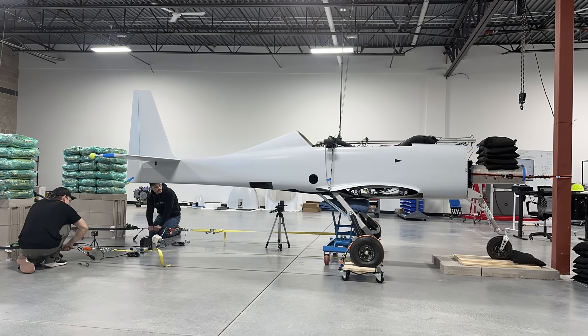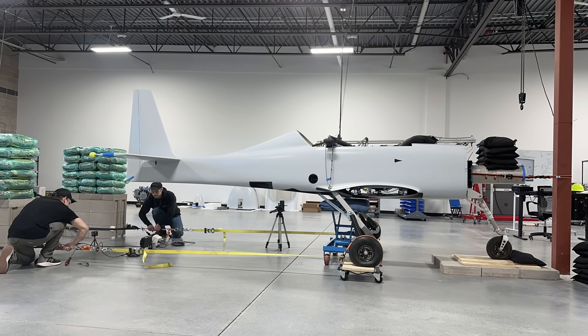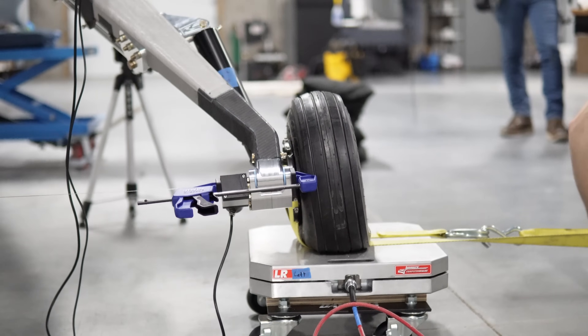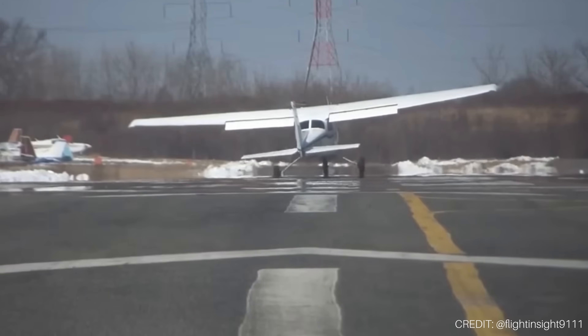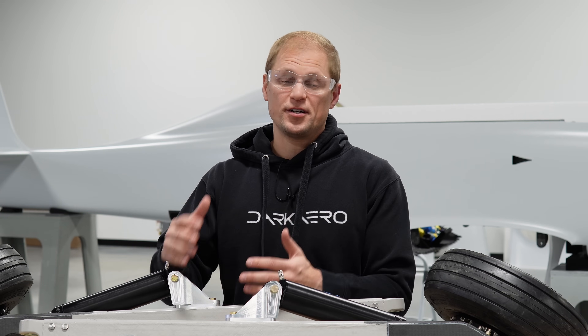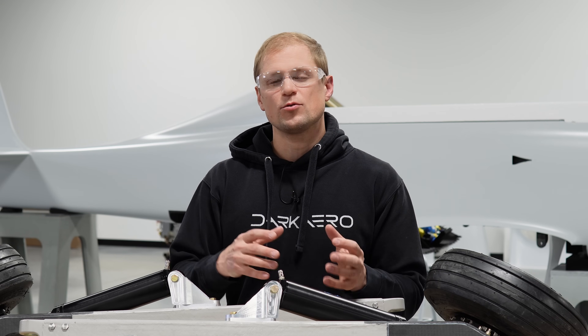There were a number of other tests we performed on the landing gear. We did brake load testing — essentially simulating what brake loads do to the landing gear — and we also conducted side load testing to simulate a crosswind landing where you impact the ground with a crab angle relative to the runway centerline. Both tests were conducted relatively quickly. By the time we got to those tests after all the drop testing, we'd already done a lot of iteration and refinement on the landing gear, so there wasn't too much left to tweak.